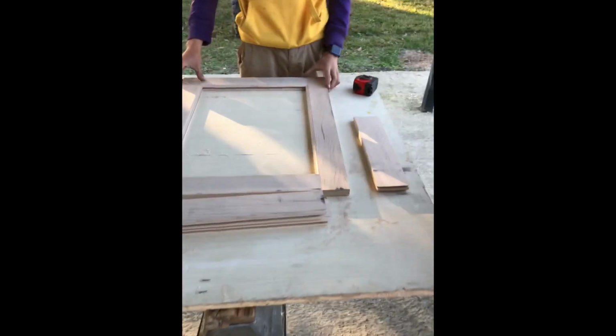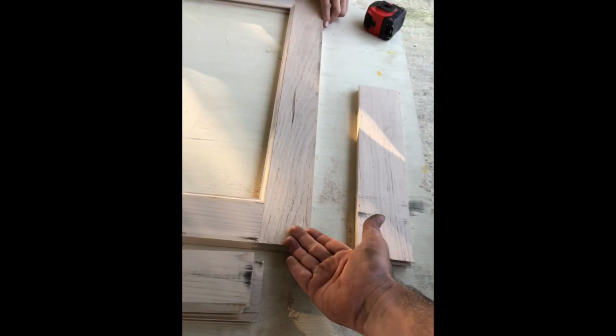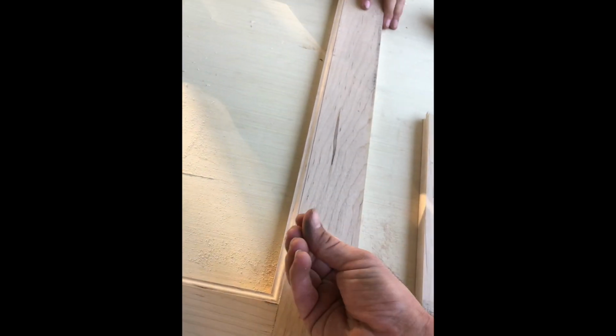So what we're gonna actually do, probably in the next video, we'll show you how we actually prep the door. We'll show you how to prep the tables. Now we're gonna show you how to prep the doors. So we're gonna go ahead and sand this down with some 120 sandpaper to clean up all these marks and everything. And then we'll go ahead and take some 120 by hand and kind of get in here and get all these little fuzzies out.